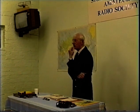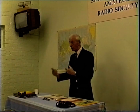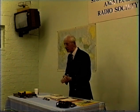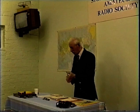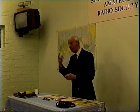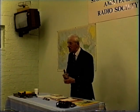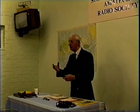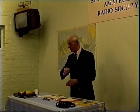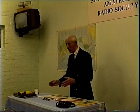I used the valve I had bought in the American shortwave set — just the chassis — from the Canadian who was going away. It was a 6K6 GT, and it oscillated beautifully in my Hartley. That was my oscillator. I used the 6L6 that the man in the twin-channel VHF had given me. Because my transformer was so small to power it, all I got out of it was 9 watts.